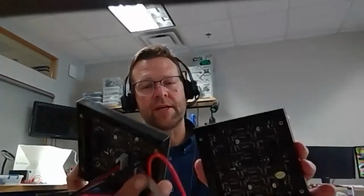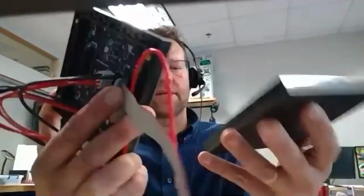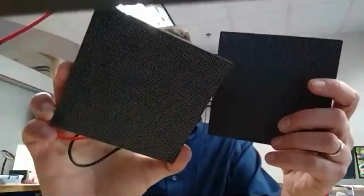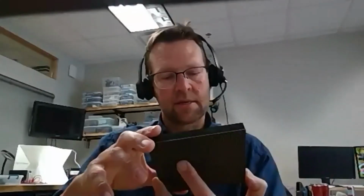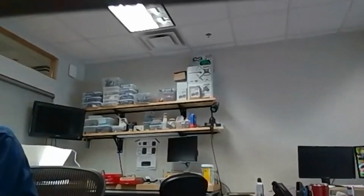But I think you can fit a mini Mac in here, plus the adapter from Stephen, and a decent sized LiPo battery. If these are the ones you end up using, and this is what you're thinking, right? No, it is those, but if you look very closely on the back frame, you'll see some screws. The heads of the screws are 1.5 millimeter diameter. I'm not talking about the heat inserts. You see the little tiny black screws on the frame? It's actually screwed through the PCB. I do. Yes. If you take those off, you can actually screw that 2 millimeter thick panel directly to a face frame. So that's the direction I'm thinking right now.